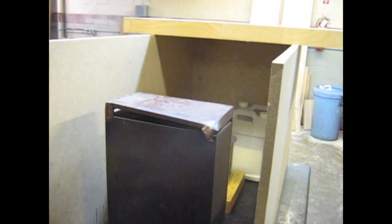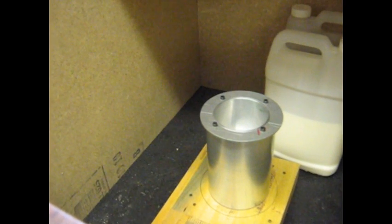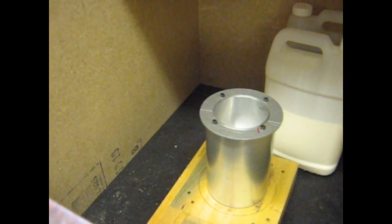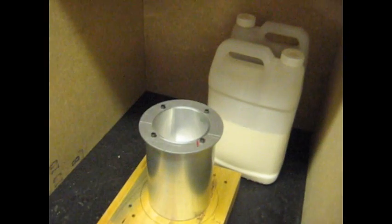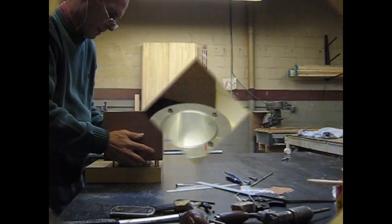You can see what I've built here — a little chamber. Right now I'm really happy that the mandrel is getting a temperature reading in the front at 100 degrees, at the back at about 80. The material itself is warmed up to 80 to 90 degrees.